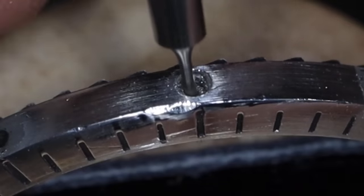Now on the sliding pinion and the winding pinion, I'm using some Moebius 9501 thick grease. But on the technical sheet, it says you can also use D5 or HP 1300. When you're installing the sliding pinion, make sure the hacking lever is in the center of the pinion. So once again, some 9501 on the winding stem. And this is the yoke spring going in now. Some D5 on the post before the rocking bar goes in, and I can hear a storm brewing.